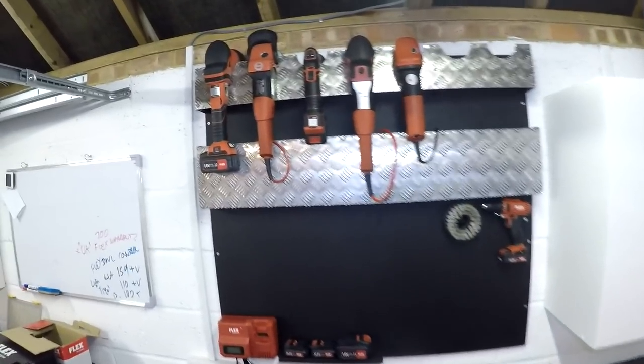So guys, I have finished mounting this. I went to B&Q and bought some bigger screws just to make sure they go all the way into the wall. For you DIY gurus out there — I'm using 8mm rawl plugs and I've got 10 of them, with 60mm screws that go right to the end. I feel like this could take a lot of weight, but it has got a lot of weight on it — I'm a little bit worried, I can tell. I just think it looks amazing. The main thing is you've got all these different sizes of tools, cordless and corded, different shroud sizes — and the Forensics design has catered for that, more by luck than judgement.